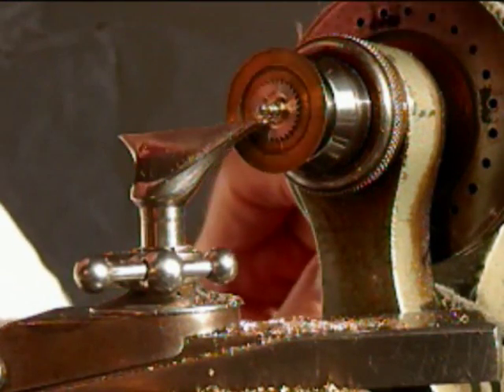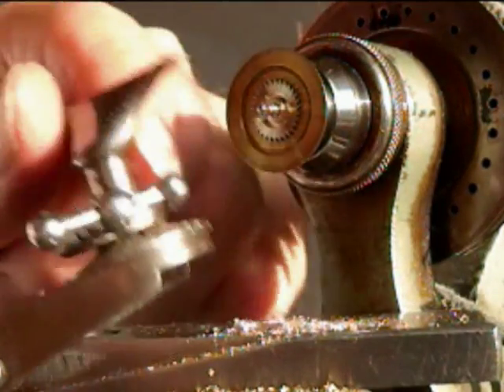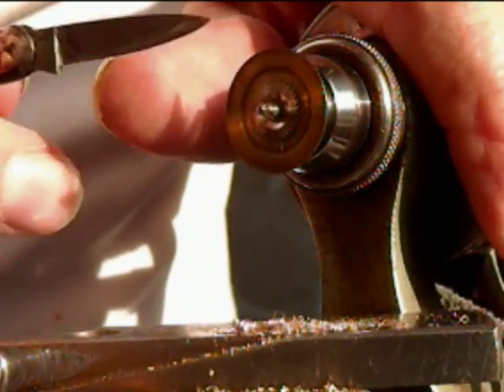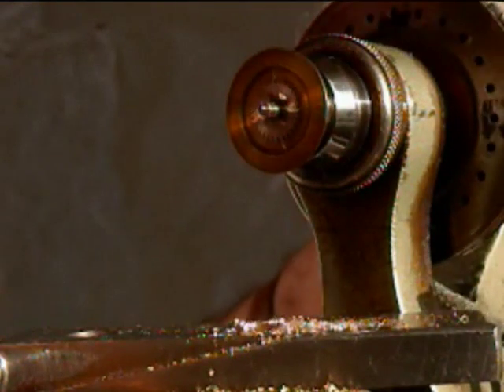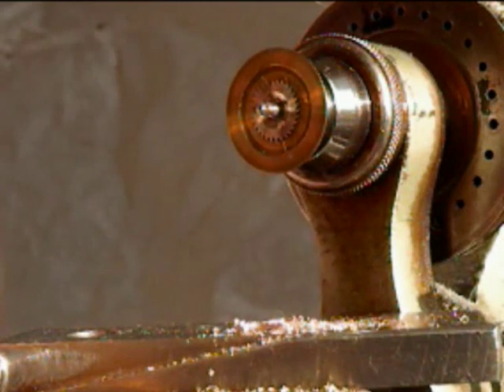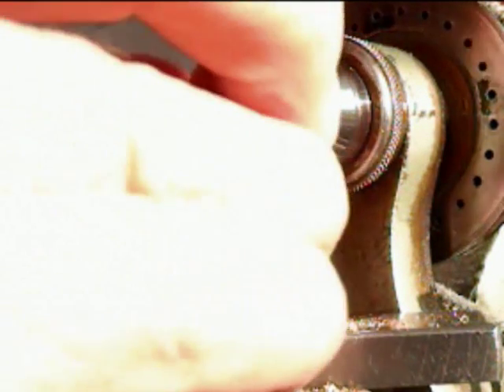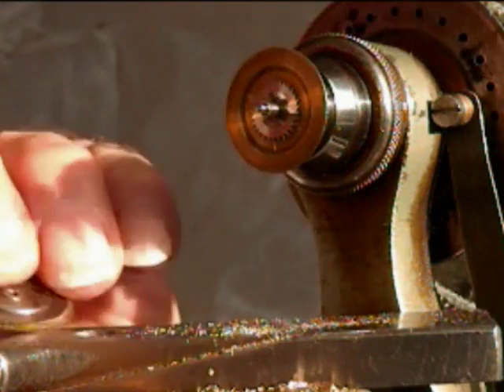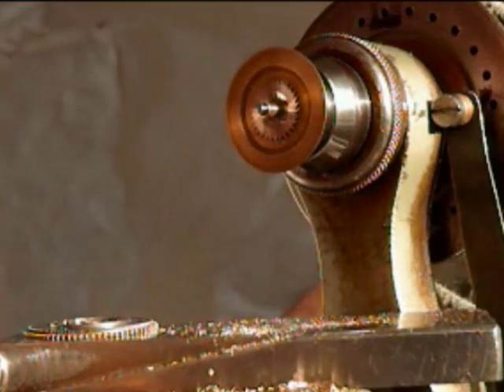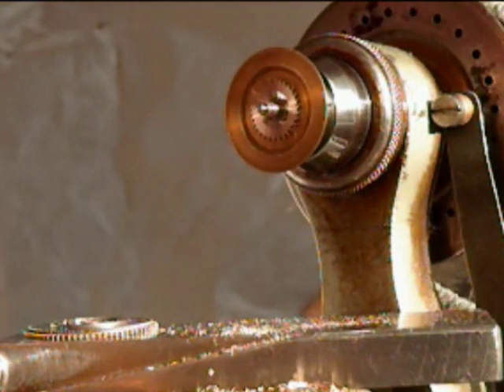The center is now broken through. It's quite a tight fit on the arbor, so I'm just going to lever it with my sharp blade and remove it — and there's the ratchet attached. Now I'm going to check that the hub fits nicely over the hole I've turned; I think it's a good size. There's the new ratchet fitted, and the tops of the taper pins have become invisible because I've turned the whole surface down.